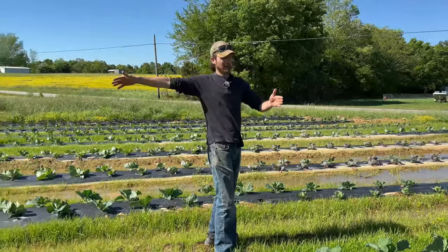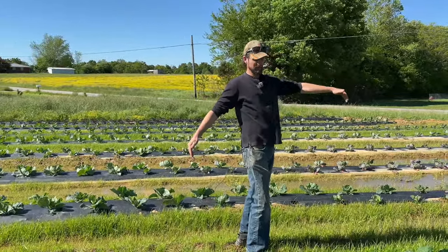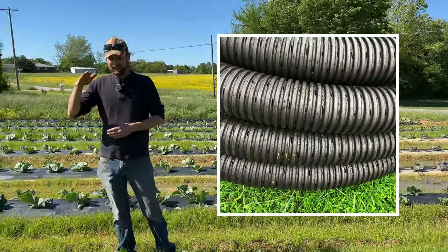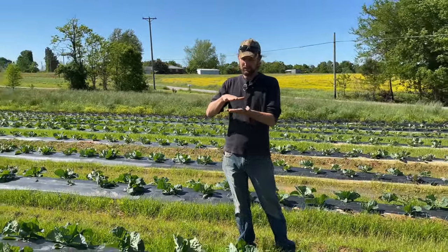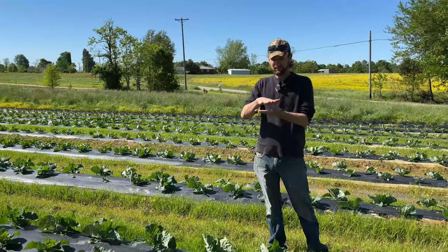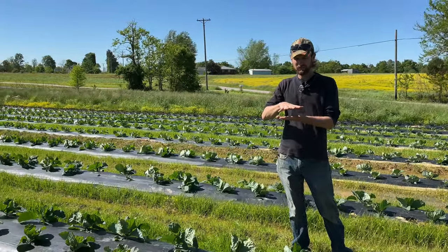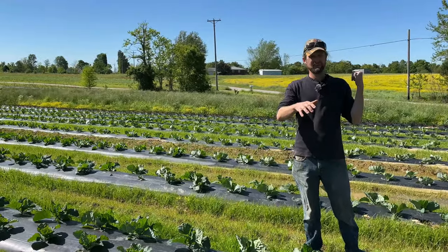The main difference here is I've tiled about 75 feet behind us, but the end of this field has not been tiled. When we tile, we put a perforated pipe in the very top of the fragipan. We want to break the top two inches off the fragipan and set the pipe down in there so that whatever water settles on top of that clay fragipan will run through the tile pipe and out of the field.